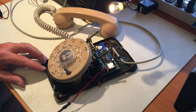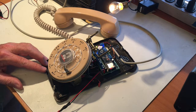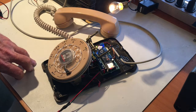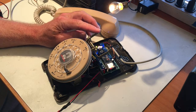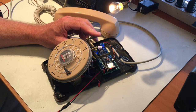'You are now programming the number that will unlock the puzzle. When you are ready, dial the number which will become the unlock code.' After dialing, it confirms: 'Puzzle solution. The telephone number that must be dialed to unlock the puzzle is five, five, five, one, two, one, two. Returning to main menu.' You can set any telephone number up to 15 digits. Seven digits is a good length — that's what most US telephone numbers were until recently, and certainly in the era of this telephone.